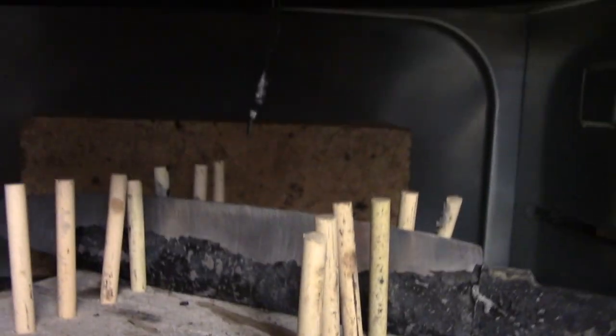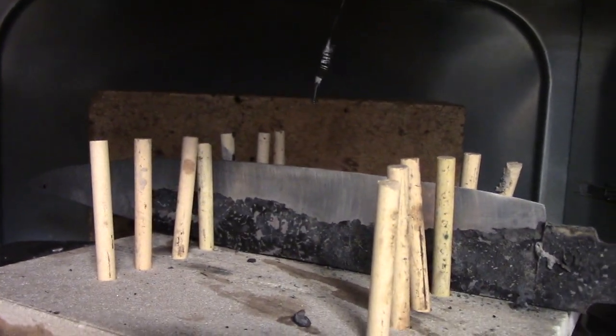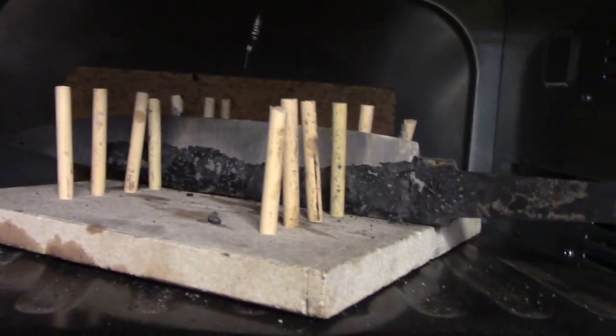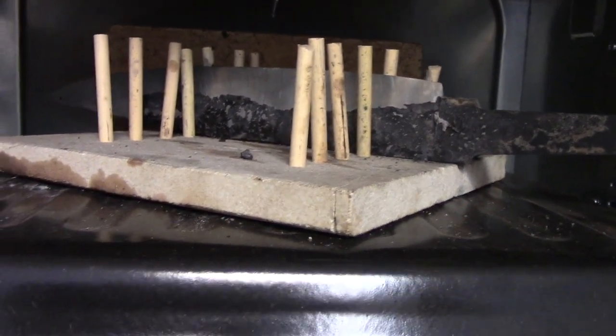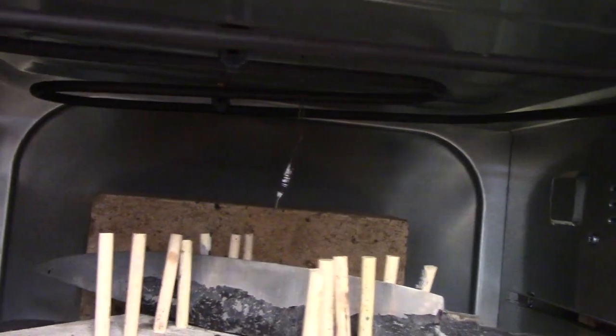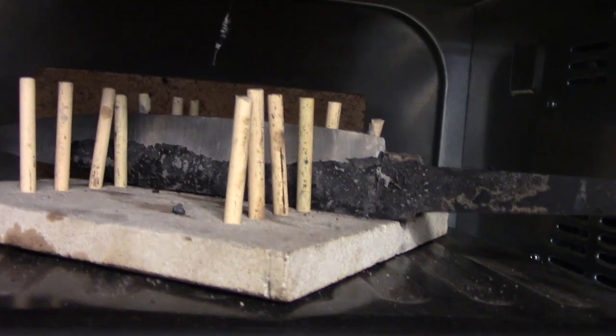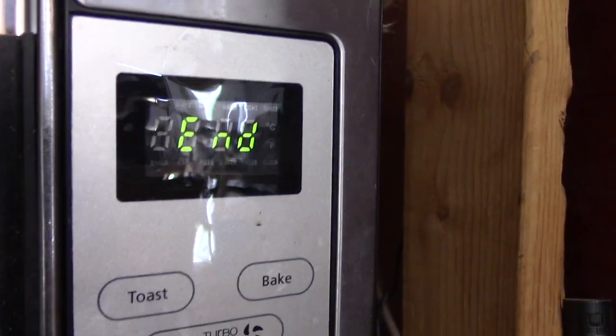So again, the fire brick in the back regulates the temperature inside this oven so that once this thing actually gets up to temperature, these elements barely work at all at that point because the temperature is pretty much self-sustaining. The other thing that I did is I don't use the temperature that's here at all.